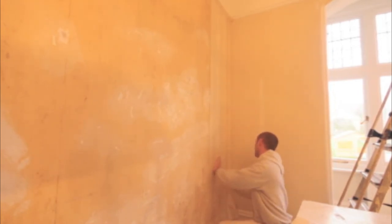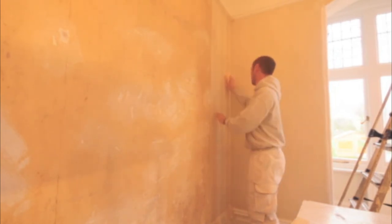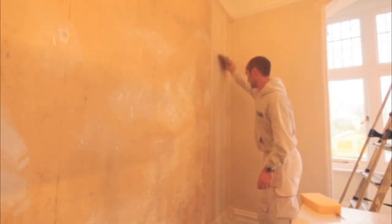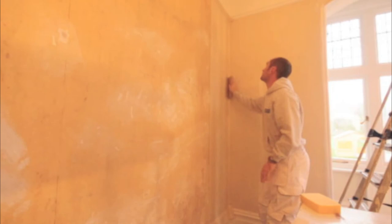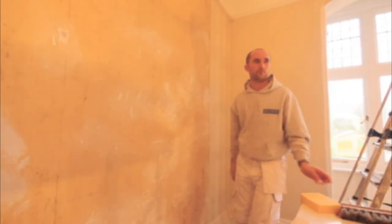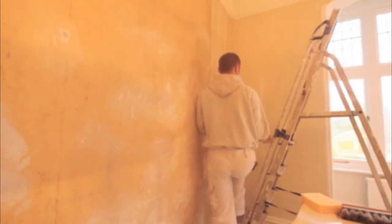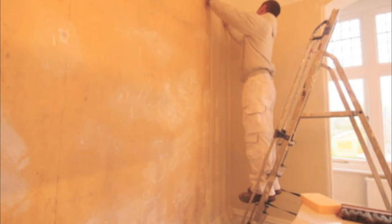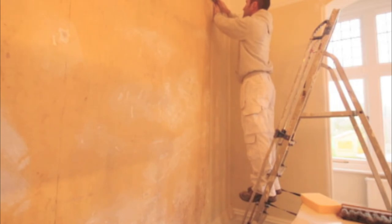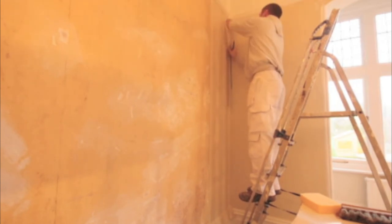On the right hand side I've overlapped onto the other wall by about half an inch, and I'll trim that off later to get a nice straight edge. Never try to start wallpaper directly in a corner of a wall, just in case that corner is out of square by a few millimetres. Once I've brushed it all out with the sponge and I'm happy there are no bubbles, I then use a good quality paperhangers brush to get it nice and tight into the woodwork and corners. For trimming, I use a straight edge and a brand new Stanley blade — keep replacing the blades as soon as they go blunt or you'll tear the paper. Press the straight edge firmly and run the Stanley knife along the top; the paper peels off straight away.